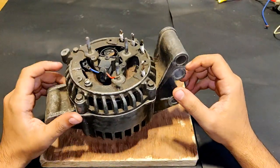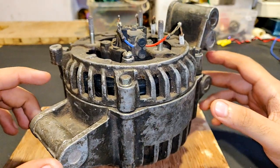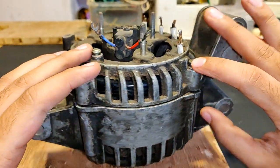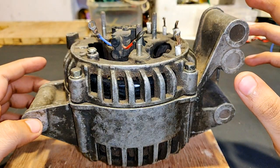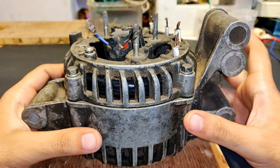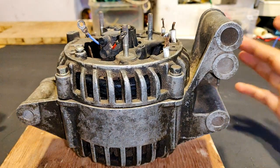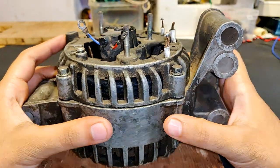The leftover voltage will still be around 25 to 30 volts, which is much more than the usual voltage. A car alternator produces 12 volts at around 2000 RPM or more, and my target is to produce around 30 to 36 volts at 2000 RPM. Since voltage is directly proportional to RPM, I can also achieve 12 volts at 2000 divided by 3, which is somewhere around 700 RPM. So let's open it up and modify it.